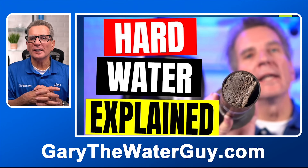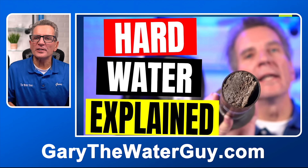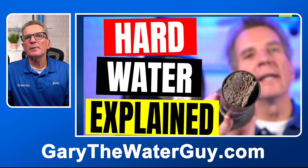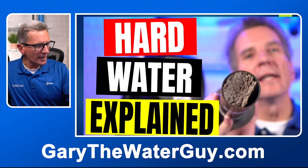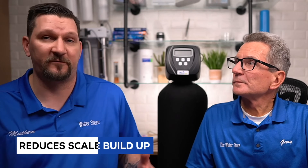In this thumbnail you can see a two-inch pipe I'm holding — it was totally clogged. It took almost 50 years for hardness layers to build up layer after layer inside that pipe. It doesn't just coat the inside of your tea kettle or the surface around your faucet — it builds up layer after layer, and that's how it ends up clogging things like your dishwasher and other fixtures. If you have a little bit of scale build-up and you introduce a water softener, the water softener will actually help get rid of some of that over a period of time.